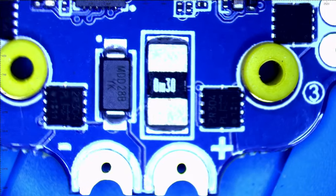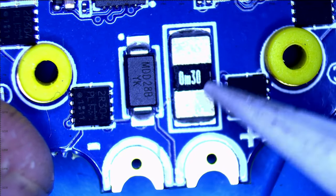Let's take a quick look at the ESC under the scope. What's truly awesome about SpeedyBee is that right in their own laboratory they do an ESC torture test. They strap the ESC to a quad with a power supply and push them hard — if it says 35 amp, they've run it at 45 to 50 amps. There's your current sensing, microcontrollers, and MOSFETs around the sides.